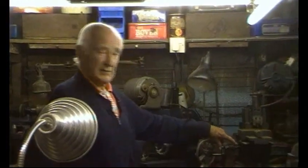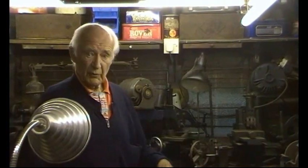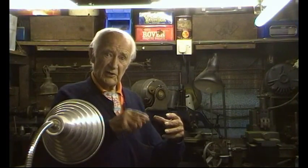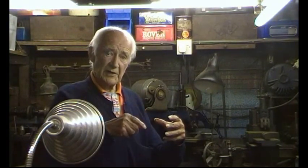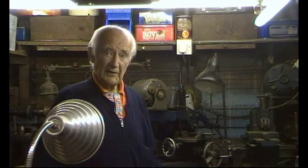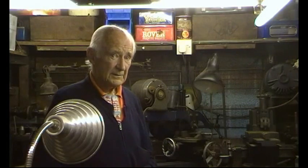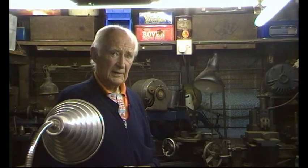Does the aluminium wear quickly? The aluminium won't — no, it doesn't. This has been in ever since the machine was built, and it's not a very big shaft. But you get a compression skin on the aluminium as you use it, which offers resistance to wear, so you get a good long life out of it. I've never seen this idea used anywhere else — this is my own idea. It possibly is used but I'm not aware of it. So rather than machining an Acme nut, you cast one in aluminium.